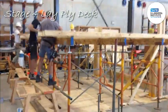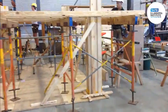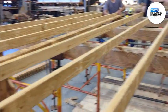The boys have now put their frames in, columns are plumbed. They've put their supports in with some scaffold tubes and tube fitting. Now they've got the spacing out with their joists, and they'll have them spaced at every 400mm to suit for the sheets.